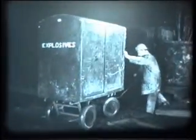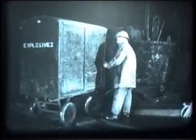Mains shot firing, with parallel connections and these prefabricated sets, has cut charging and firing times down to less than 1 hour. This system has proved itself highly effective and is now being applied at other sinkings. Since misfires are rare, the system is safer. We've also been able to increase the number of shots per round to get a more effective pull over the whole shaft area. Buzz wires can be laid underwater if necessary, and the number of connections that have to be made at shaft bottom are reduced to 4.